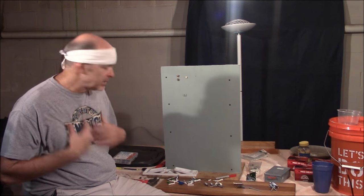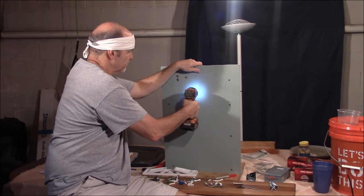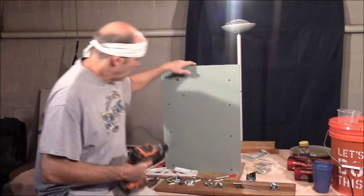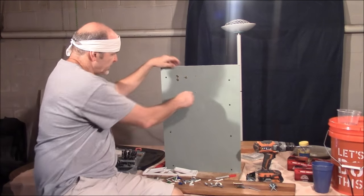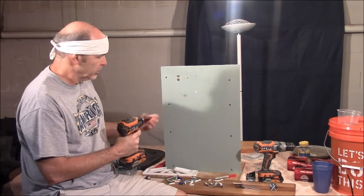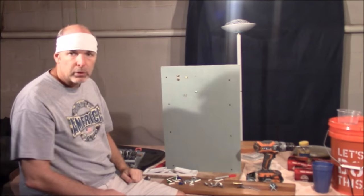My rule of thumb when I'm hanging something — I always assume I'm going to find a stud. So I'll put a screw in first. That went in and just spun around, so I don't have a stud. At least I know that's the hole I want to use. I'd follow up with a drill bit, get the anchor in there, and if needed, drive it with a hammer. Then when I follow it up with the screw, that anchor will expand in the drywall and hold it in place.